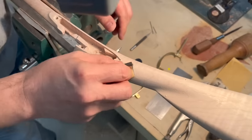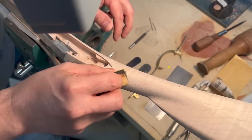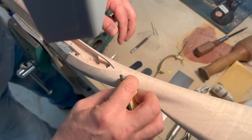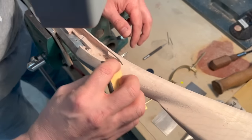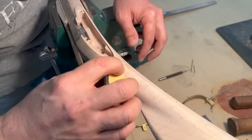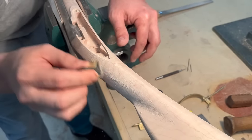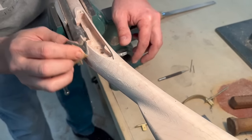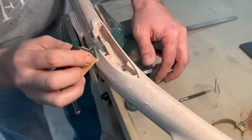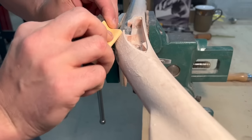And you don't really want to round those over too much. I mean, sometimes you might want to round them over intentionally, but it's a good practice to be able to sand and then round them over if you want at the end. Then you can control the degree of radius on the side of your lock panels. Sanding a stock takes some time. There's no way around it, but it's not necessarily hard work. It just takes some time to do a nice job of it.